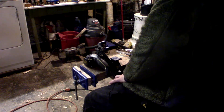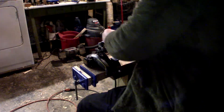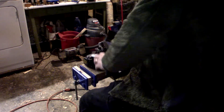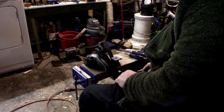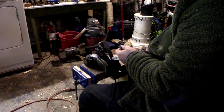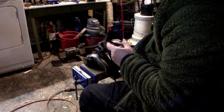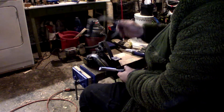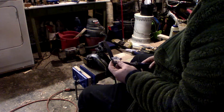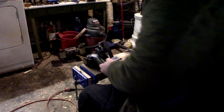I used two different grits; now I'm going to a finer grit — the next step down. I continue doing this until I'm in stropping mode. The heavy brown belt that we used for the initial profiling I typically won't use again after that. When I'm just basically honing this edge on a regular basis, I'm going to do it often so I'm not removing too much material. I'll start with the heavier grit gray belt, then the next grit, and then my polishing belt — but I'm not typically going to use the brown belt again. I need to even out this edge with some more polishing with the lighter grit.